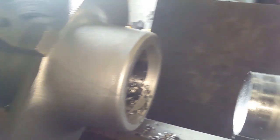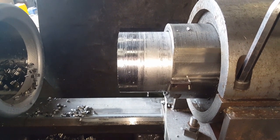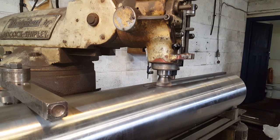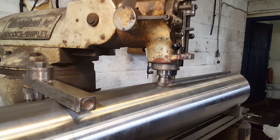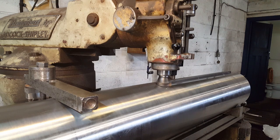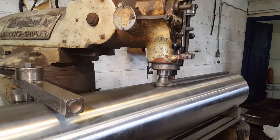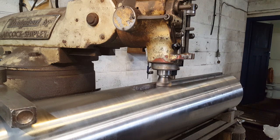So now I've done this with this tool, what I need to do is counterbore it — put a better finish on and get to size, so I will just jack out the outer cartridge. Cut one millimetre each side, two millimetre to remove from the bore, give it a decent finish. I'm hand feeding this by hand. Now I've come this way, I don't want to waste a run back so I'm going to put 20 thou on. It just saves me time.